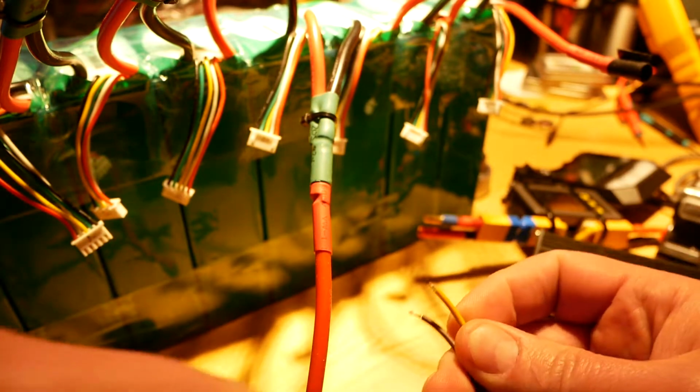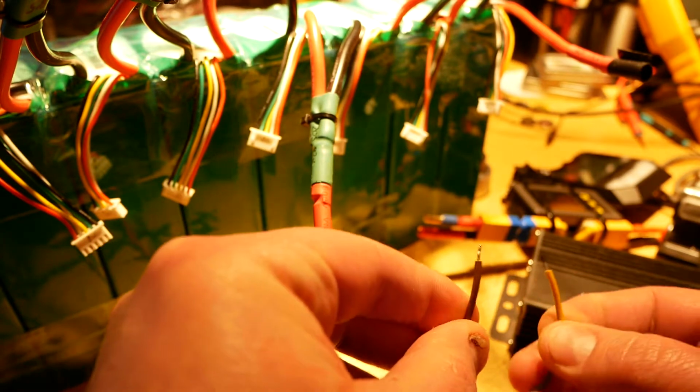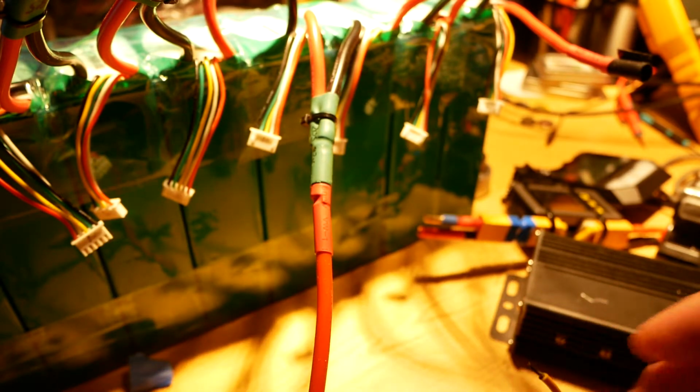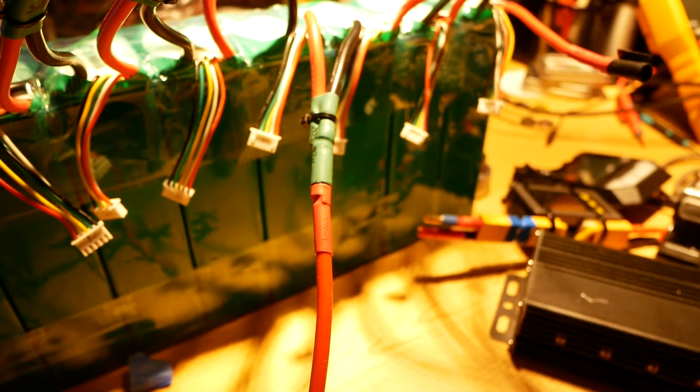And of course, the ends of the wires are more scorched. Okay, and I'll discharge these again. Pow! Capacitors are unharmed by this. It's just everything else: connectors, wires, electronics, all that stuff is getting these wild voltage spikes. And of course, the arcing that you just saw, which is bad for everything. All of that is going to slowly kill your electronics. And yet, no wheel I've seen deals with this properly.